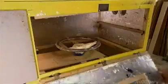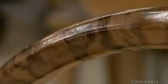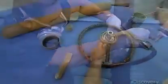The next day, they remove the clamps and put the steering wheel in an oven for about eight hours to cure the glue. Once it cools, they file away excess glue that seeped out the seam, then sand the entire surface silky smooth. They protect the delicate veneer with eight coats of resin, cured in the oven for optimal durability, then polish the surface with a series of compounds to produce a glossy finish that highlights the richness of the wood grain.